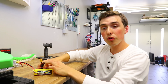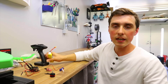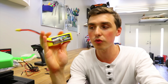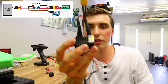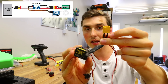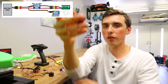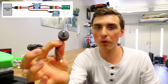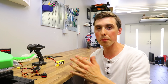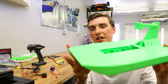Let me go through the electronics — I'll post links in the description so you can build one yourself. RC airboats are as simple as it gets because it's only a handful of components. First, we have a lithium polymer 2200 four-cell battery that powers everything. The battery connects to an RC car electric speed controller — the motor plugs in here, the battery plugs in here, and the receiver plugs into the ESC. This receiver talks to the transmitter, and that's how you control it. This is the motor. Super cheap components — you can probably get everything for under $100, and you can transfer it all to future printed builds. For steering, there's a small 9-gram servo, literally two to three dollars.